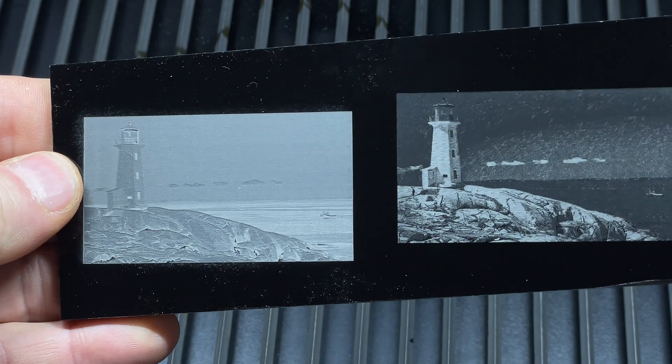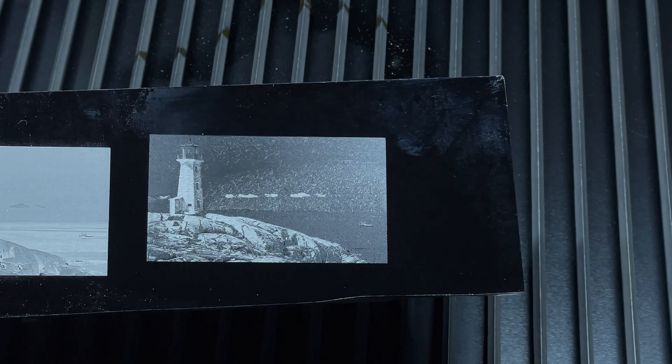That first job was a clear indication that even though this laser is just 10 watts, it's actually a pretty decent cutter for 3-millimeter plywood at least, and the engraving is great because it has a pretty small beam size. Next, I wanted to see how the WeCreate Vista handled images, so I loaded up a grayscale of my lighthouse. It could have used a little more power to be darker, but the detail is actually fantastic — again a function of that smaller beam size on the 10-watt laser. Finally, I put a piece of black acrylic in and used Jarvis dithering, and the lighthouse came out great. All in all, I'm pretty impressed with both the engraving and the cutting given that it's a 10-watt laser.